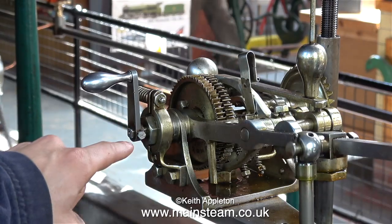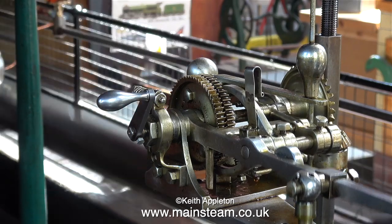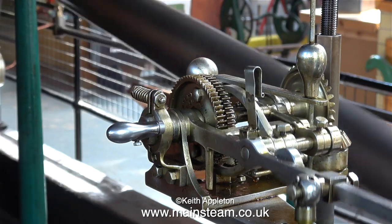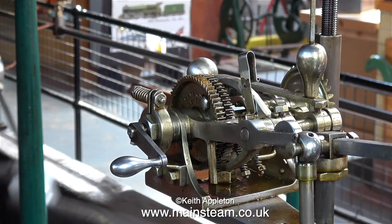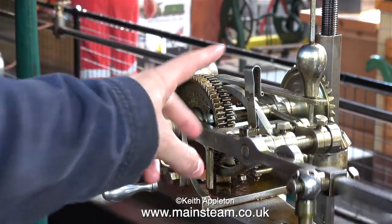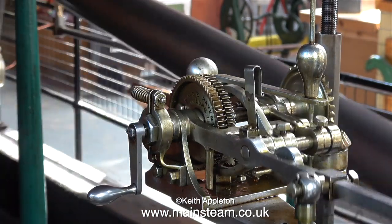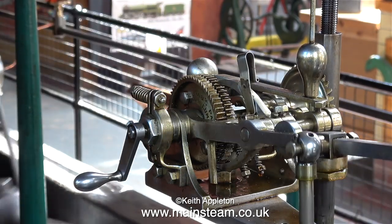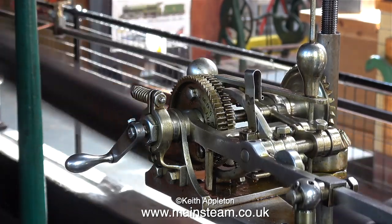Because a steam engine is a reciprocating machine, there will be changes in speed over the course of one revolution. A governor will pick this up and hunt up and down. The looms in a mill depend on constant engine speed. A difference of plus or minus 2 RPM on the main engine can seriously affect the weave quality of a loom. Turning the shaft one way or the other by the ratchet wheels will adjust the speed of the engine via valve timing adjustment. But the key is, one ratchet tooth at a time produces a smooth and fine adjustment that eliminates the RPM differences by the governor hunting.